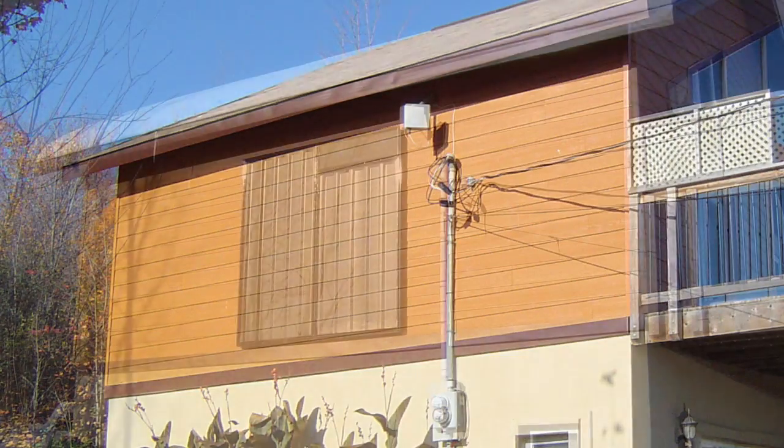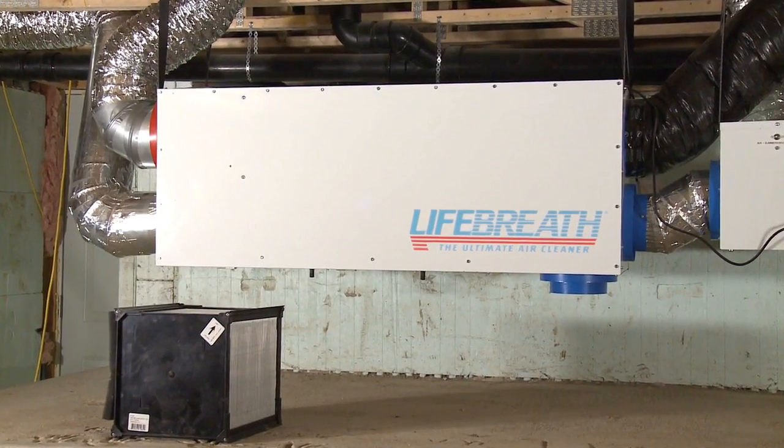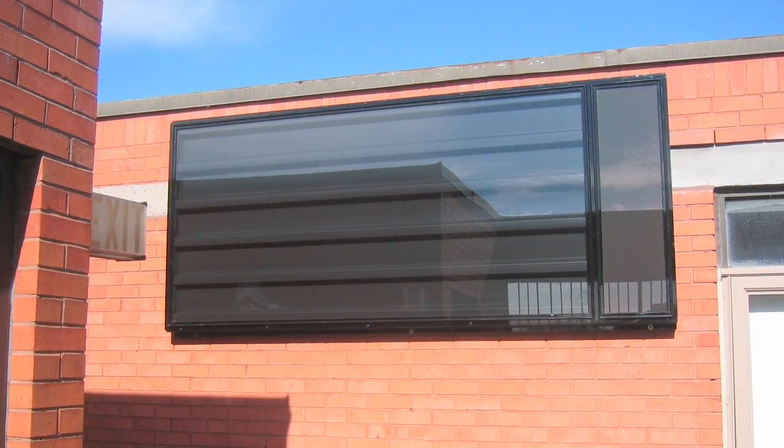Most people, when they're looking at this product and calling to inquire, are probably looking for one or two sheets in a house that's already built. Correct. The solar sheet or sheets can be applied to a south-facing or west-facing wall to provide space heating to that residence. In new home construction, since it is an airtight home, an HRV for fresh air full-time ventilation is installed. Both the solar sheets and the HRV can be installed during new home construction. If it was an existing or retrofitted home, it may be more difficult to install an HRV after the fact because you have to open up walls. But for just a solar sheet system, an installer can quickly knock two five-inch holes in the wall and the solar sheet can be installed within a few hours.